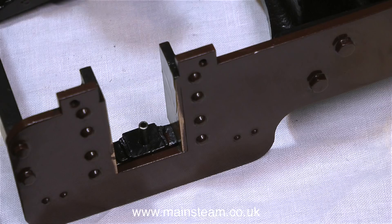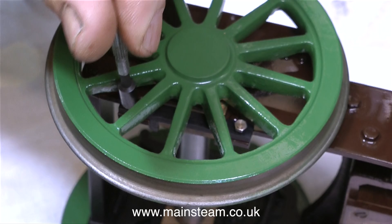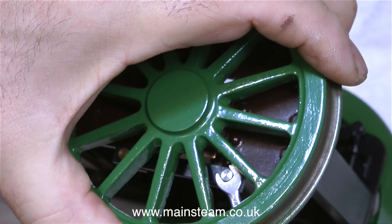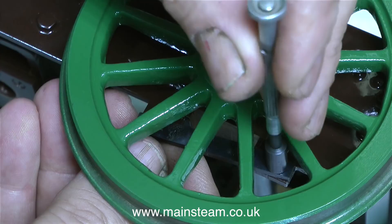Time now to refit the wheels to the bogey. I needed a special tool for this because a normal socket is too big to go between the spokes, but this one fits perfectly. So one by one, first with the socket and then with the spanner, I fit the axle box keeper plates back in place, being very careful not to mark the paint on the wheels. One problem with miniature steam engines after they've been painted is making sure you don't damage the paint, but luckily this paint is really well stuck to the metal.